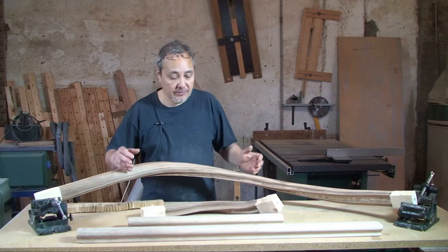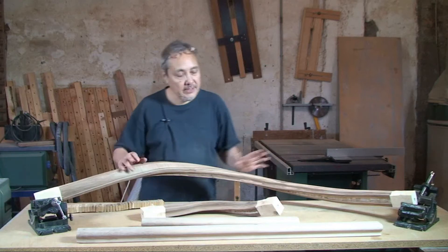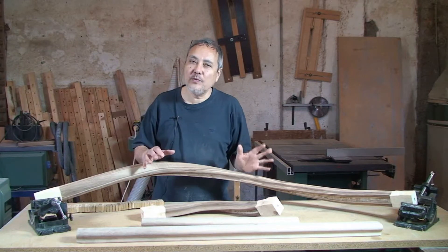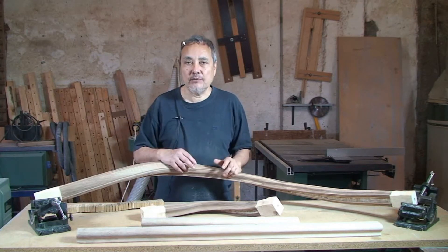The actual project is in fact just these two wreathed sections plus these straight sections here. These handrails have been made using our laminated sections technique, which is a technique that we have set up, specially developed, for making wreathed handrails that follow metallic rails.